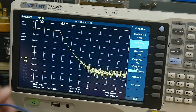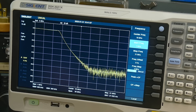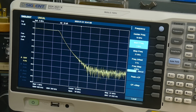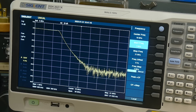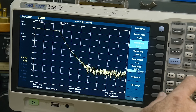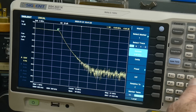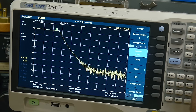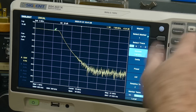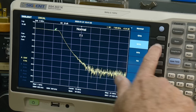There we go — it looks very nice. It looks better than the prototype, a little bit cleaner as far as wigglies. Let's measure the cutoff point — it's cutting off around eight and a half megahertz. That's good. So if you're going to be transmitting, let's say you transmit at 7.1 megahertz, that's you there.